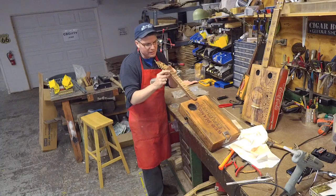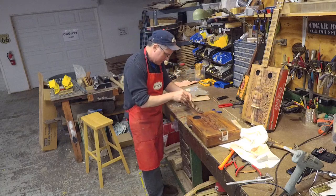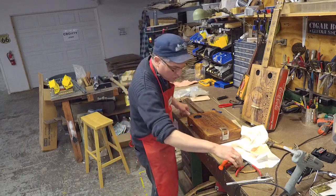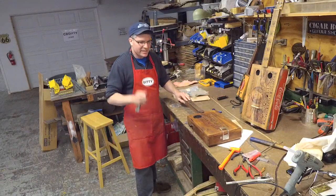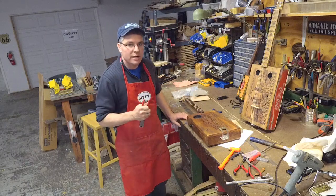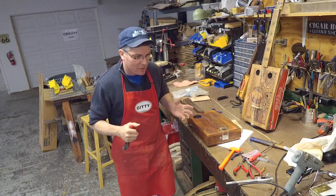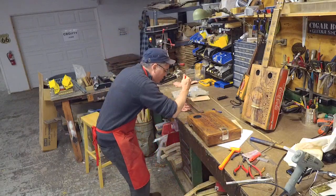Since I was up, I've got this up. The second fret here is a little wonky. It isn't rocking, it's not a seesaw fret, but this end edge of it is sticking up a little bit. Maybe I pounded it too hard when I was installing it. Since this one is seated better and more firmly, I have to be more careful when I take it out, so that I don't pull the wood grain up with it and cause chips to pull away. It's not the end of the world if it does happen, but I'd rather avoid it. I don't want to screw up the fretboard.